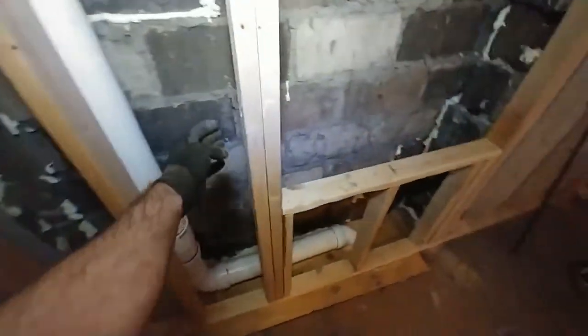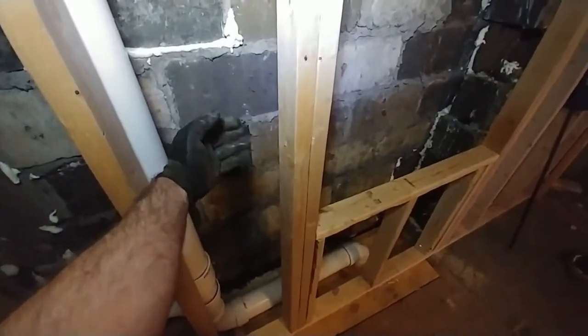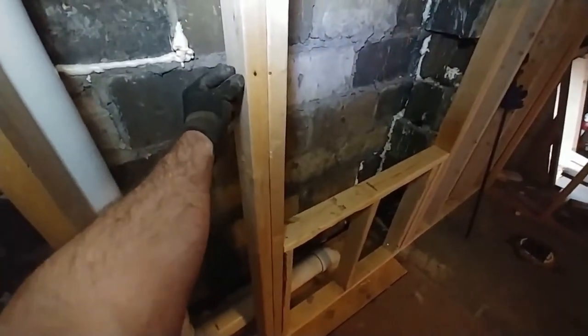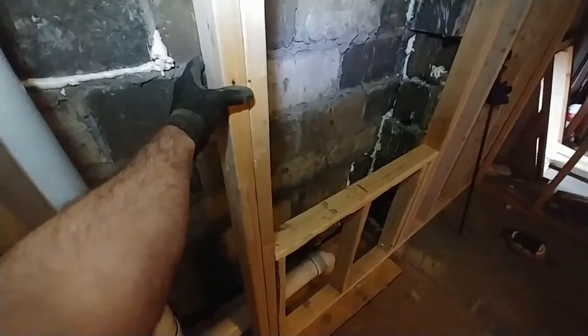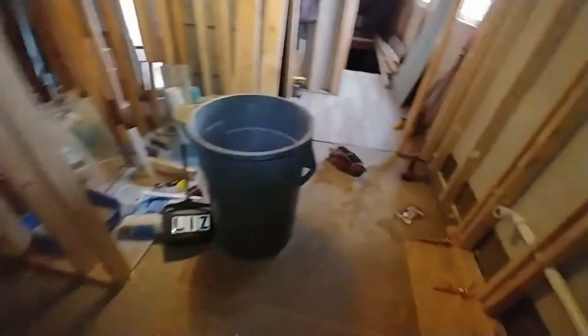We're going to play it. Now this wall is in here on the inside surface of that framing wall downstairs. So we're going to basically run it on the center line of this wall's thickness, and know that we're, you know, 10 inches away from the outside. Downstairs, we'll go down there, and maybe this will make it clearer what I'm saying, but the 2x6 wall downstairs is further toward the outside of the building. And so